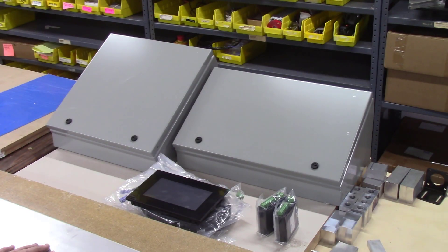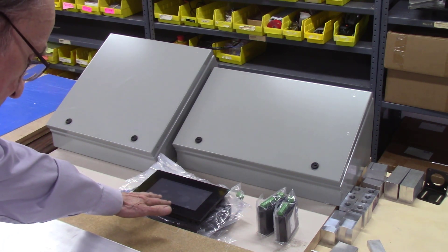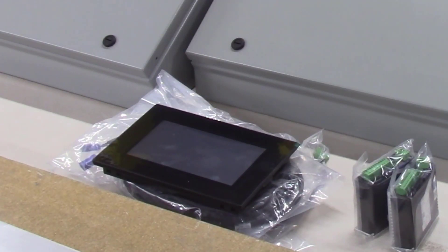There will also be quite a few changes in the electronics. The two cabinets in the background are larger with a slanted top, and all electronics will go inside these boxes. I'm planning on using a touch screen display on both units — the display panel will mount on the slanted top and will eliminate many of the buttons and lights on the previous model. The larger display panel will also show the actual position of the indexer and board position, and display the actions being conducted when slicing. However, the display panel will require a lot of programming, and I anticipate I'll probably spend more time programming the system than actually building the basic automated AccuSlide system.